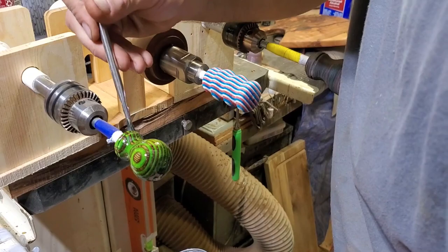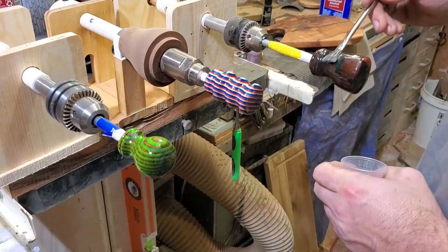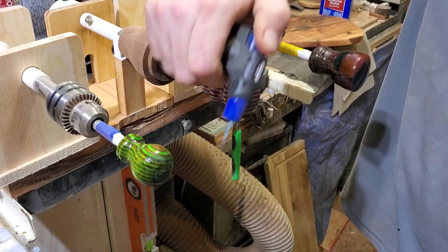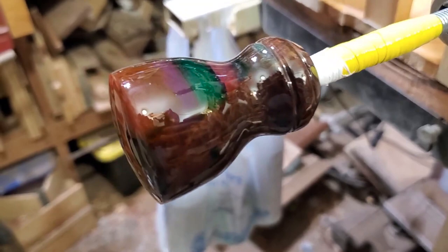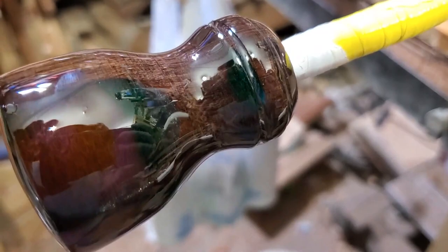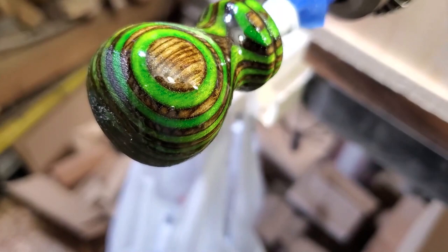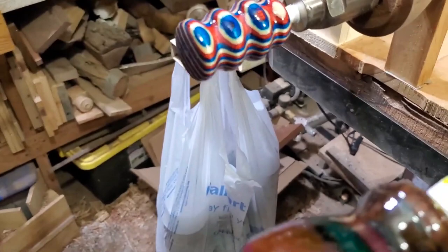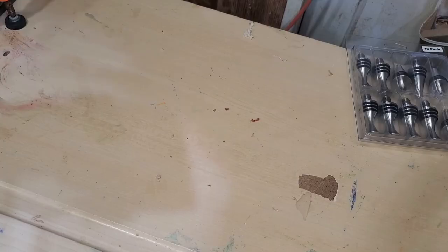I do just a light coat on the base just to seal it — I really don't care what that looks like down there. You've got to pop the bubbles like any other resin application; keep it moving. It's easy to burn these little thin layers. You can see how all those scratches disappear because that resin just fills them in — beautiful finish. This blank isn't the prettiest because it was just my scraps, but somebody out there will like it. It's got Texas ebony in it if you can see the wood. You can see just how much those are soaking it in. You could sit there and try to pop that stuff, but there's really no point because you're going to have to sand it anyway. Sand those back by hand, just a hair — 120 grit pad — hit them with a second coat and they will look great.